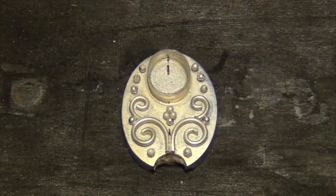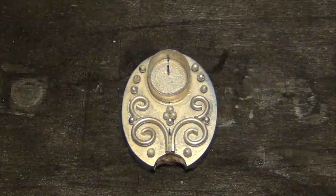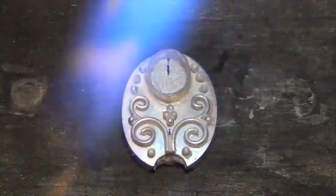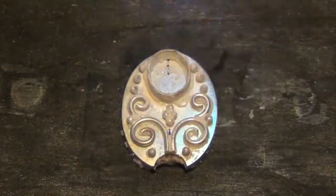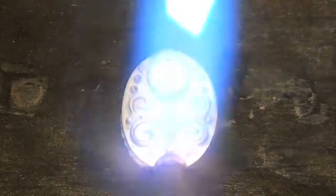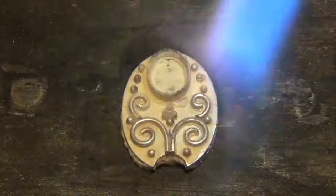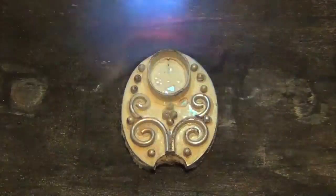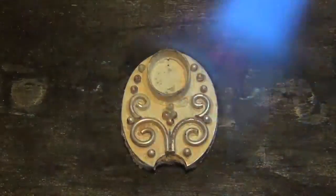The clay does not have to be dry — it will dry very quickly with the torch. So I kind of feather the flame to make sure everything stays in place. If the granules start to move away because the flux has bubbled up, just stay in there. The capillary action of the flux, when it becomes liquidus, will pull them back into place.